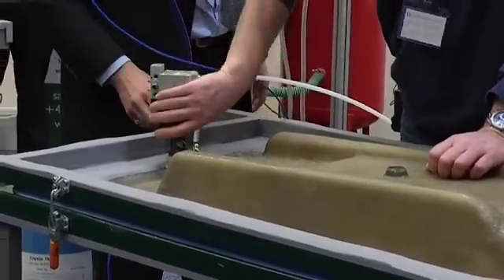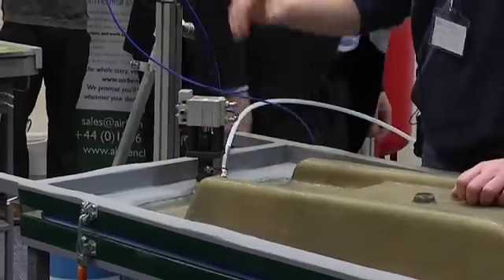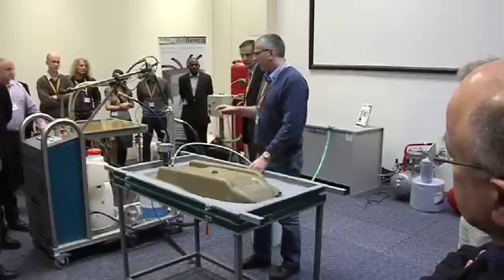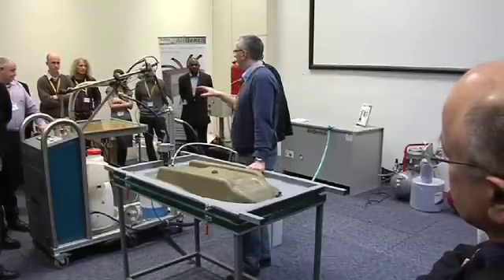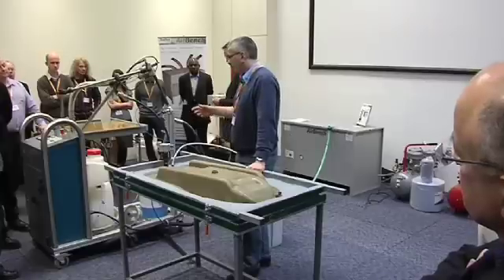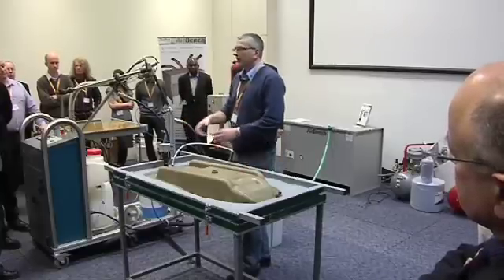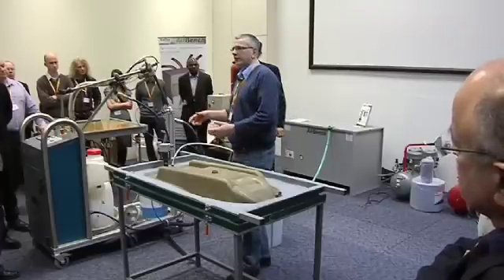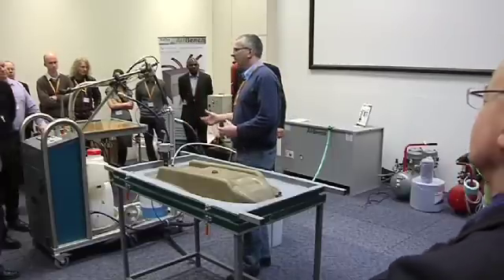The valve you can see here is just a clean method of connecting an injection machine to a mold. In production it lets us be fairly efficient — we'd generally have one machine with lots of different molds — so we connect the machine up to the mold, inject it, and while that's still liquid and curing, disconnect the machine and go inject another one. This valve allows us to inject the mold, clean the whole system through, and then disconnect the machine while we've still got liquid resin curing in the tool.